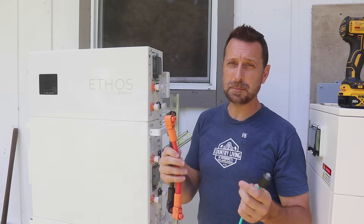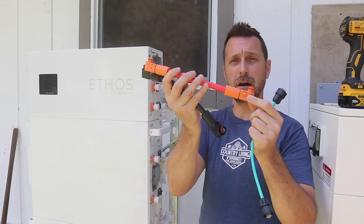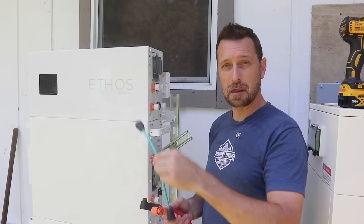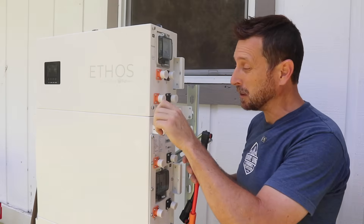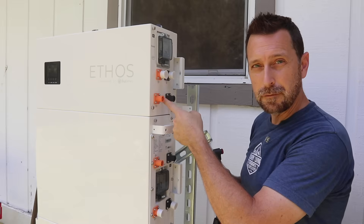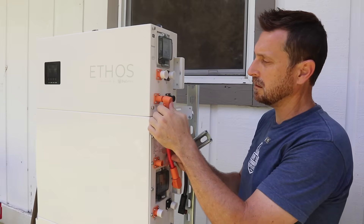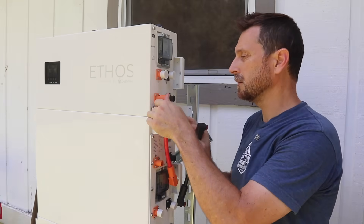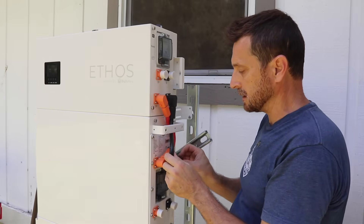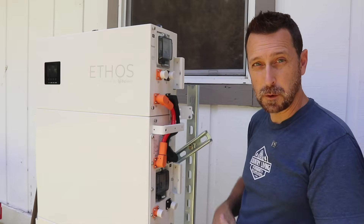Let's start the wiring. Each battery comes with a positive and negative battery cable — each has Amphenol connectors on either side. It also comes with a communications jumper which goes on the other side of the batteries. This is really just plug and play — take off the protective caps on the bottom of the battery control box and the top battery, bring the connector up through the handle, and just pop it on. You'll know when they connect properly because it pops and a little button pops out.